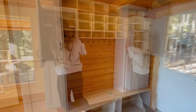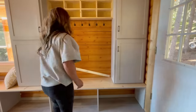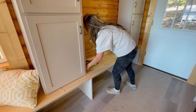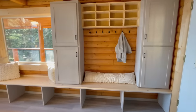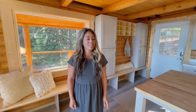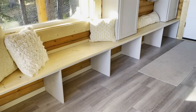I switched to 5⁄8-inch brad nails for nailing on the back panel. I love adding hutches like this to mudrooms because it's great for mittens, hats, and other small items. I used 1¼-inch Kreg screws to attach to the side cabinets. I also attached the cabinets to the wall using 2½-inch screws and then trimmed everything out. The project's all done — a 14-foot-long mudroom that I was able to build all by myself. Having the cabinets was a huge bonus, but if you can find some leftover cabinets, you could definitely make something like this. The bench really is the ticket here; the plans are linked in the description, so check those out.